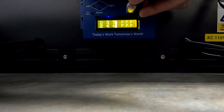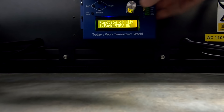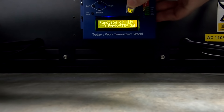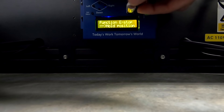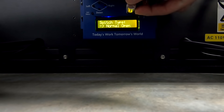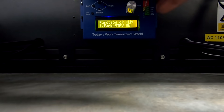Now I'm going to show you how I set this switch up. Here is the function of the KLM — it's sitting at park standby switch. If you press this knob once it'll change to the menu. Turning the knob gives another option of E-stop only, which I don't want — so I'm staying with park standby switch. Pressing it again gives me hold position or kill power for the function of the E-stop — I want it to hold position. Then it gives me the switch type option: normal open or normal closed — I want normal open. Press it one more time and that sets it up with all these options set the way I want them.